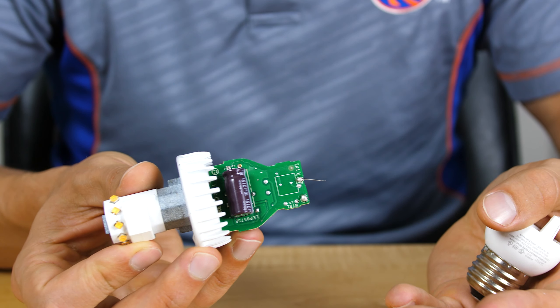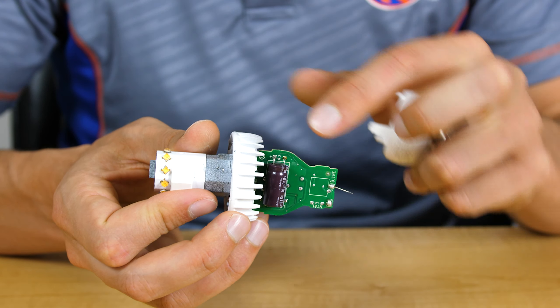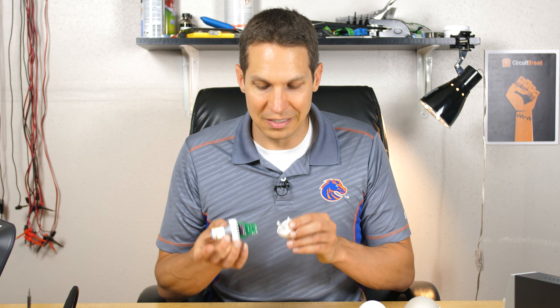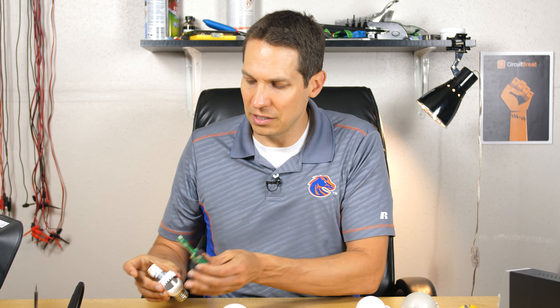There's not really much of a mechanical connection between the heat sinks and the electronics themselves. I don't understand how they thought this was going to have very good heat dissipation, because normally if you do heat sinks on a board, you want things to be touching — conduction is so much better than convection. I'm wondering if that's why this burned out, because something overheated. Despite these massive pieces of metal, there was just really no way for the heat from the electronics to get out.